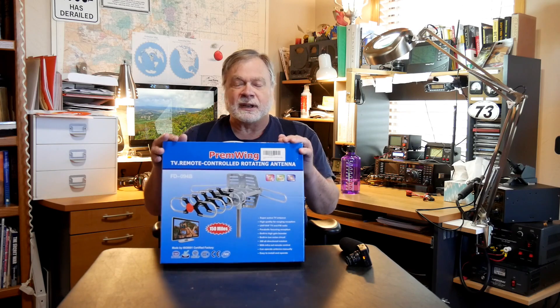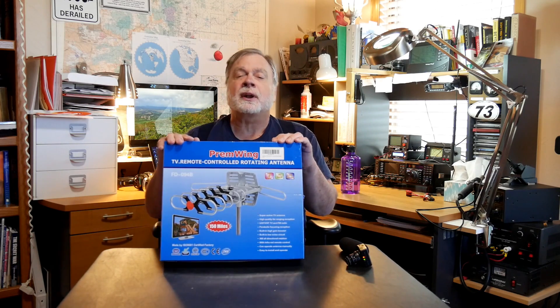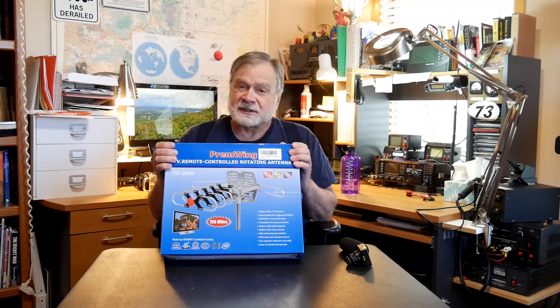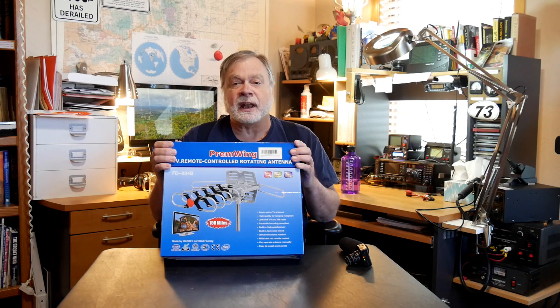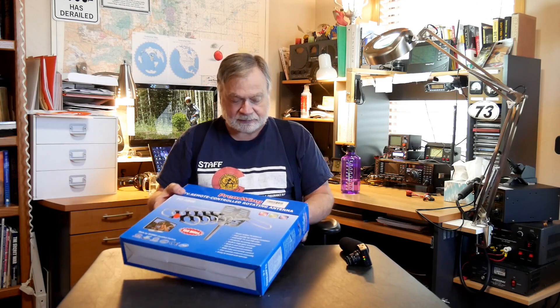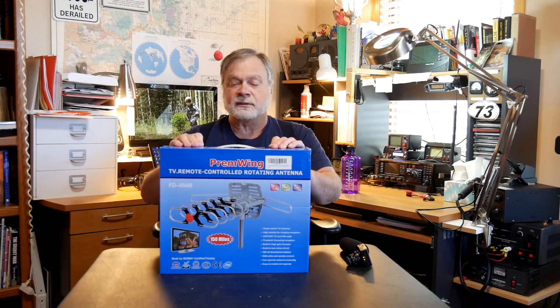The thing that interested me was that the antenna specs seemed to overlap some of the amateur radio bands, and I've noticed that MFJ has this very thing in its catalog under a slightly different name. Let's open it up and see what's really inside, and then we'll see if we can have it receive some high-definition television, because that is what an amateur might be doing if trying ATV or amateur television in one of the higher UHF or microwave bands. Old ATV signals from amateur radio operators tend to take about 6 MHz bandwidth. HDTV is much more efficient — you get a far better picture at only 2 MHz bandwidth.